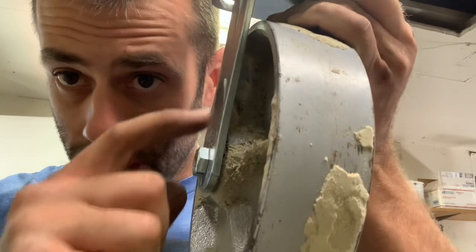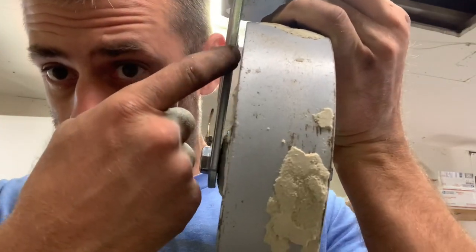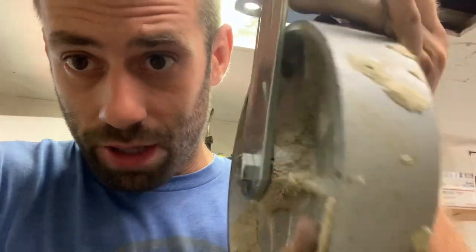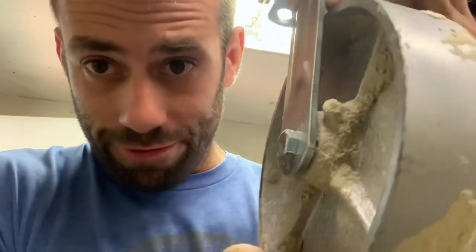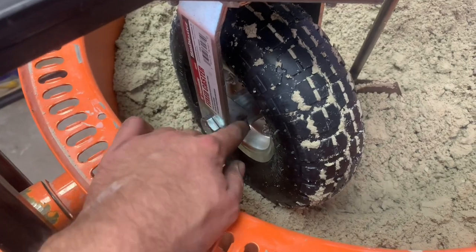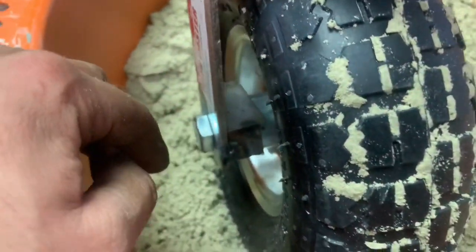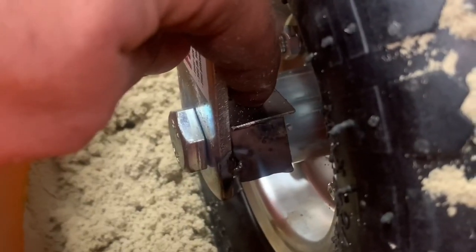What happened with the wheel is that as it was turning, sand was falling straight down into the axle and into the bearings, and it just jammed up full of sand. So I ended up getting a different kind of wheel where the axles are a little bit more hidden. In addition to that, I just tacked a little umbrella that I made — just some sheet iron — to keep the sand from falling directly on top of the axle.